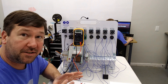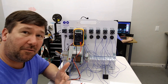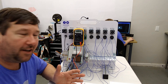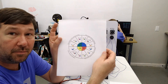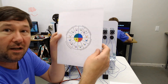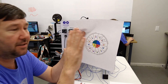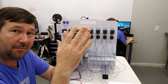So there are the basic calculations for figuring out the relationship between volts, amps, and resistance in series and parallel circuits. Let me know what you think of this video in the comments. I usually go for more practical troubleshooting, and in this case we did have to pull a calculator out — let me know if you thought it was helpful for building your troubleshooting skills. I believe it's important to understand the Ohm's Law pie chart, as exercises like this give you opportunities to understand it more. This is the basis of voltage drop and how far you can run a wire for a given amperage. Please make sure you hit that like button.